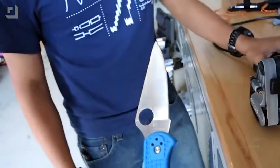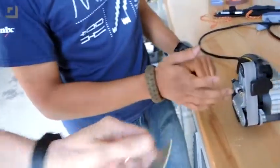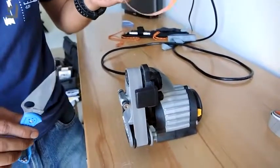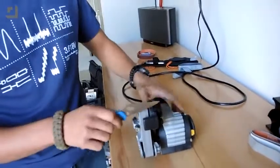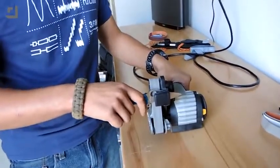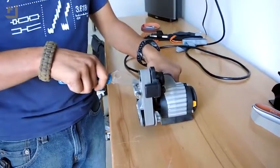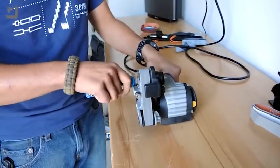By the way, one of the things you can do, depending on what type of blade you're sharpening, is you can adjust the speed at which the belt is running. That's useful for higher precision — you generally want to go for a slower speed. For something like a pocket knife, we obviously go something faster. Now, what grit are you using on that belt? They have a couple of different grits. They have a coarse grit, which will eat a lot of material away very quickly — they don't recommend you use this on knives unless you have something really messed up. The belts are labeled X65, X22, and X4. We're using kind of a medium grit; they do have a coarser grit that we won't be using here.